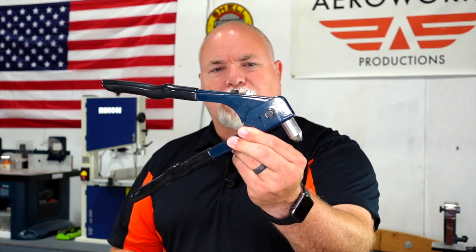You've probably seen one of these hand pullers — you simply insert the rivet, squeeze a few times, and the rivet expands. One thing to note: aircraft rivets are not the same as the ones at your local Home Depot or Lowe's. These are specially made for aircraft usage, come in a variety of styles and sizes, and are typically aluminum with a steel shaft in the middle. The tool pulls the center shaft inward, mushrooming on the inside, creating a tight fit between your parts. For small or hard-to-reach pieces you can use a hand riveter, but if you're doing several thousand rivets, you're not going to want to do those by hand.